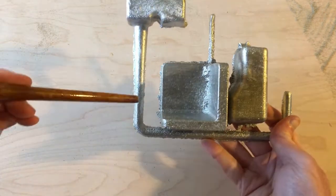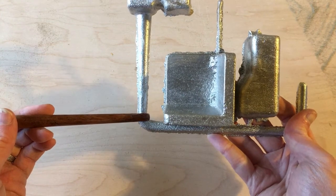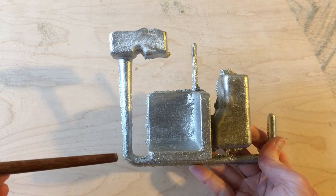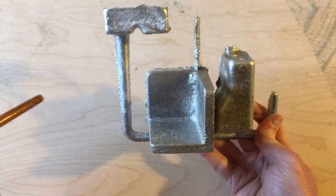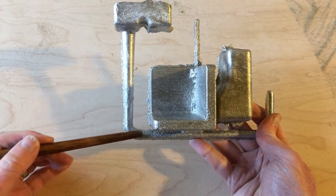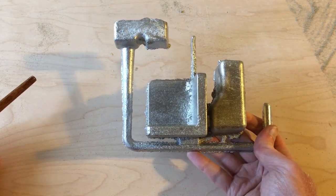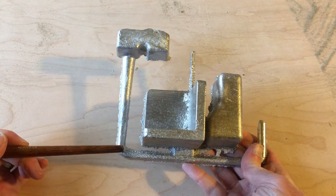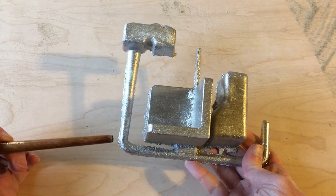We got a lot of flash here. But this bend is really one of the points of having the vertical parting plane. When you have a drag and a cope with the parting plane level, it's hard to make a gentle sweep from the bottom of the sprue to the runner. But if you mold everything in one side and then tip it up, it's easy to mold in this nice streamlined bend from the sprue base to the runner.